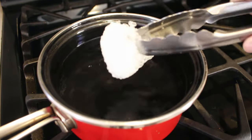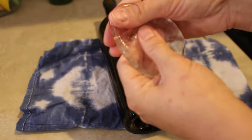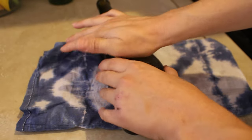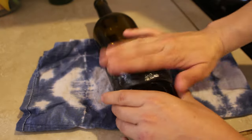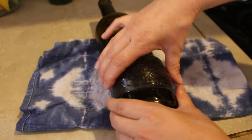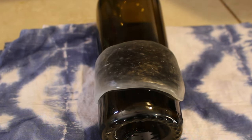The goal is to mold it onto the wine bottle so you have something to hold on to. You don't want to make just a tiny little spot — you want to make almost like a bracelet or a cuff around the wine bottle so that you can use your hand to hold the jig as you're drilling. Once you have the shape you want, let it cool down and harden. You'll know it's ready when it turns opaque white again.